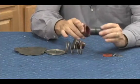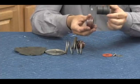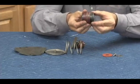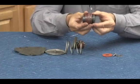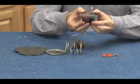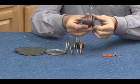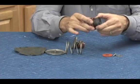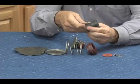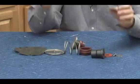Well, think about it. If that O-ring swelled, what would happen to my relief valve opening point? In other words, my relief valve opening point is conditional on this stem moving on and off the seat. If suddenly that O-ring is tight, now it gets real tight because of a swelling action, is that going to change my relief valve opening point? Of course it is. So that's a very important part of this relief valve, that O-ring that sits in the middle of that stem going across that stationary spacer. Very important that we lubricate it properly. Proper lubrication means out of the holder, fingers lubricate, greased, all the way around in a 360-degree fashion.